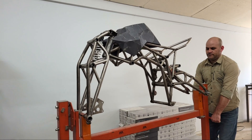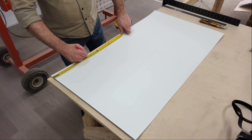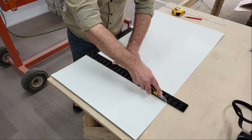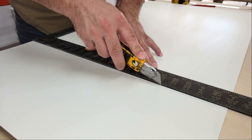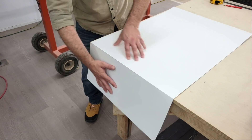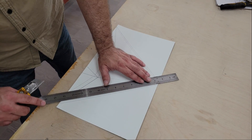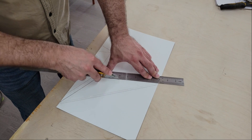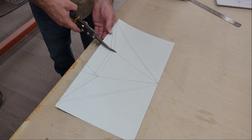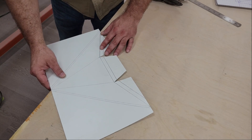With the test out of the way, I moved on to making a cowl for my motorcycle. As I mentioned in the Scan Ferret video, I like these scanners because as a builder I can model things in the real world and convert them to digital a lot quicker and easier than modeling them in CAD. I opted to bend the cowl out of thin aluminum sheet instead of carving it from foam because there are no compound curves to deal with, and the smooth surfaces and straight edges will speed up post-processing in CAD after scanning. This aluminum is a common flashing flat stock sold pre-painted at most building supply stores. The trick to bending it without a metal brake is to lightly score the opposite face with a knife and straight edge, then fold along the score line — but don't score too deep or bend too many times, as this can also cut the material.